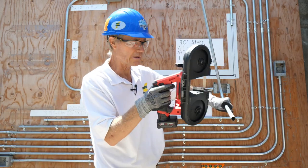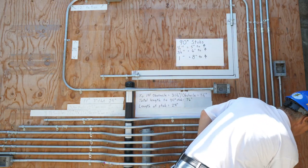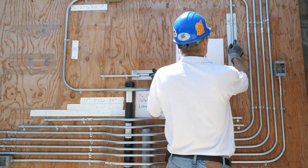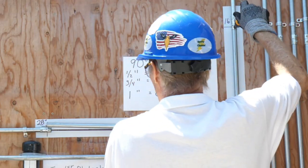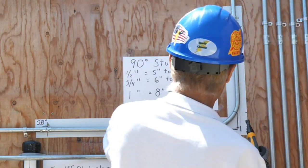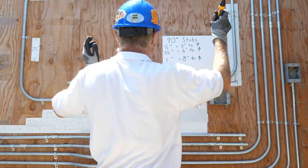So we're going to take our bandsaw, get it nice and straight, cut it, then ream it out. Here's our bend — we're going to put it right in here. I like to put it in the upper one first, just take it and tighten that down. Put it right in here — beautiful. Tighten this baby down. There you go — put a couple of one-hole straps on there and you're done.